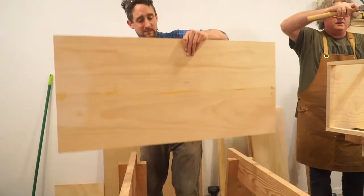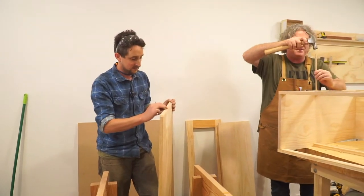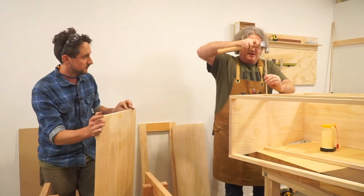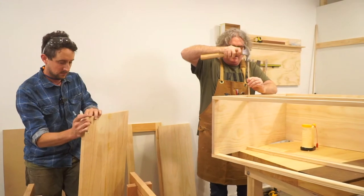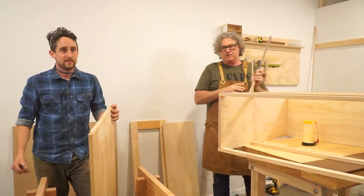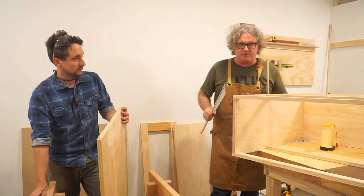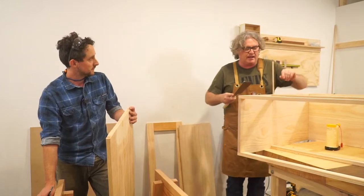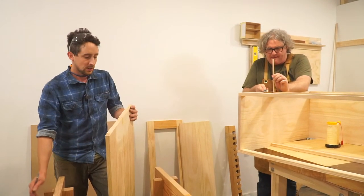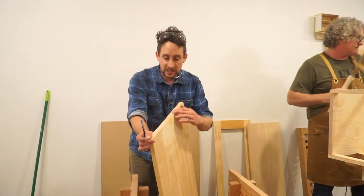This screw and dowel technique's really been pushing this pine timber to the edge of its capabilities. I found that when I was drilling out, we were getting a bit of tear out on the material, but we'll talk about that a bit later. Sure. When you've got time. Yeah? So that trimming bit has given me a nice clean edge.